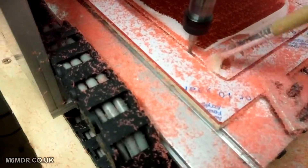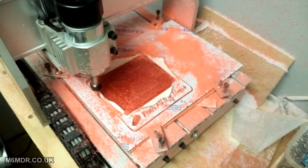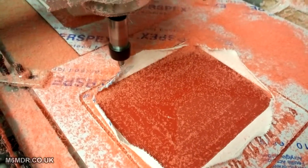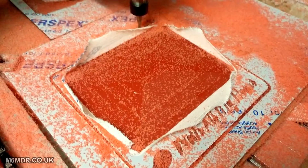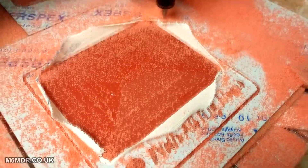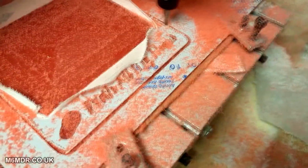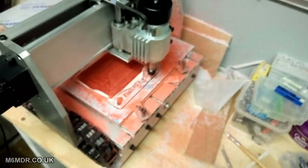If you can get a vac or an air blast to clear this out — you can see my machine's absolutely covered in crud, it needs a good clear up. These aren't the best end mill cutters, so if they get a bit damaged I'm not too bothered, only a couple of quid a piece. But one thing I will say is get yourself a set of roughing out bits and a couple of good finishing bits that you don't use for roughing out — let the rubbish old bits do the work and then get your nice finish with some nice clean seldom-used bits. It's getting a bit noisy so I'm going to back away, but it's cutting out nicely.